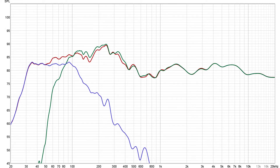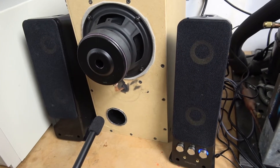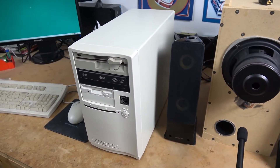An interesting thing happens when we test the subwoofer and our speakers together — I'm overlaying this chart now with the red line indicating the new measurement. You will see that they match up almost perfectly except for the range between 45 Hz and 100 Hz. In this region we didn't have any frequencies at all, but with the two speakers playing together we do have a fair amount of amplification, and this is one reason why adding a subwoofer to your PC speakers can be a good thing. For the game test, the 5-inch subwoofer in the isobaric configuration is hooked into the GigaWorks T40s, with the measurement microphone about 6 inches from the face of the subwoofer box, connected to the Windows 95 retro PC.